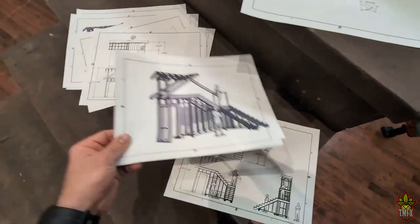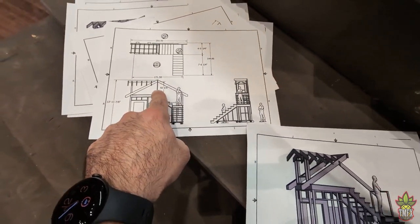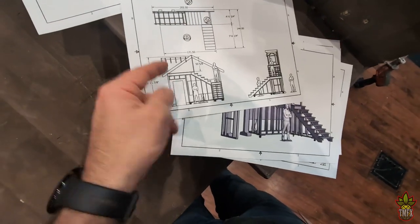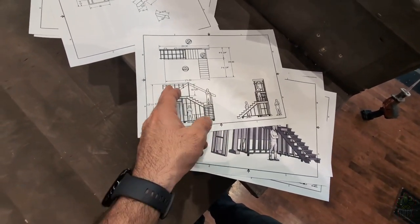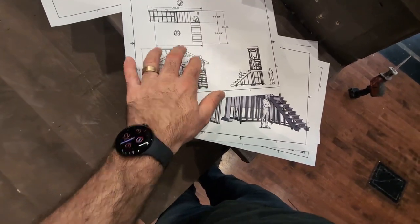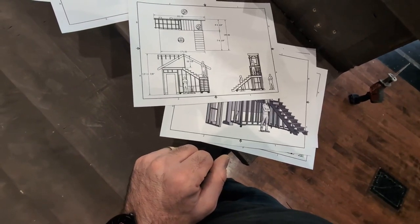The other thing that I did is I came up with the height of the post. So if I get a 50 5/8 post in there, a 2x4, then I can put the ridge king in, and then I can make the rafters per this design sheet, and they ought to go up there and sit in the bird's mouth and go up and land on the king, and real quick today, be able to get this sort of thing started. And if I frame the gable end and put its ridge king on, then it's down to a few rafters. And so I could get to a lot of what's shown up here today if I'm content with it in general.